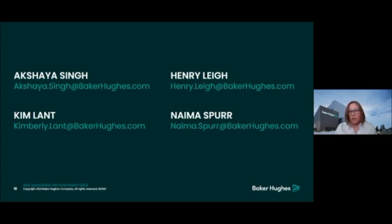We didn't go into a lot of detail about the core flow, because it was a high-level view, but we're more than happy to go into more detail if you'd like to have one-on-one meetings. I can tell you that the testing for the results you saw today was on Berea sandstone of about 800 millidarcy. The test temperature was 200 degrees Fahrenheit, or 93 C, and the net overburden for most of these was 1,000 pounds.